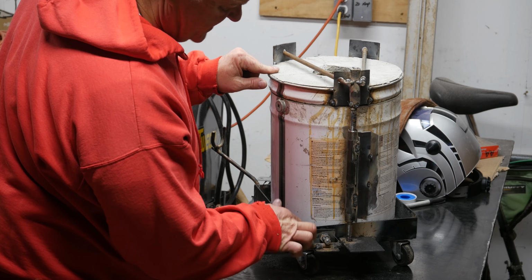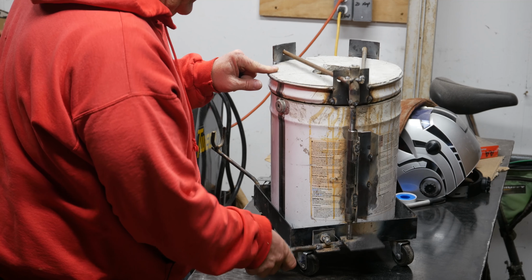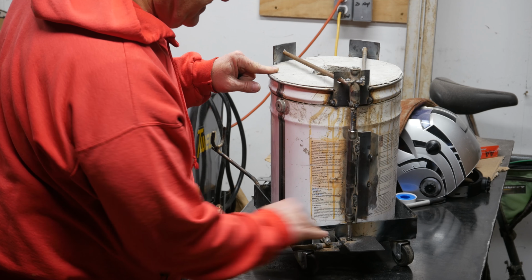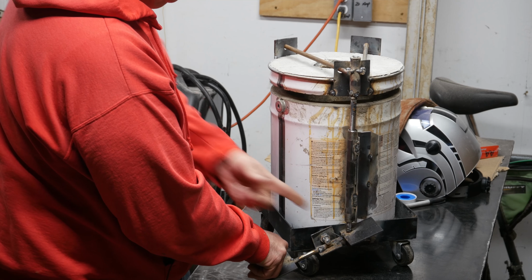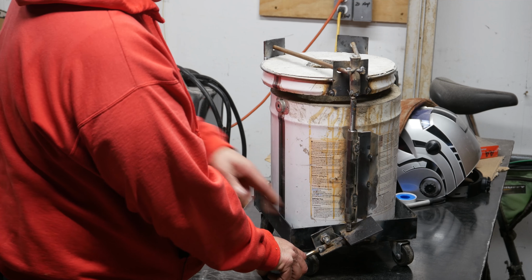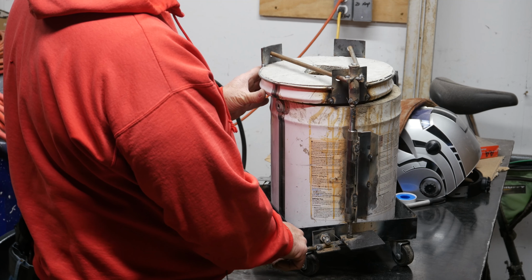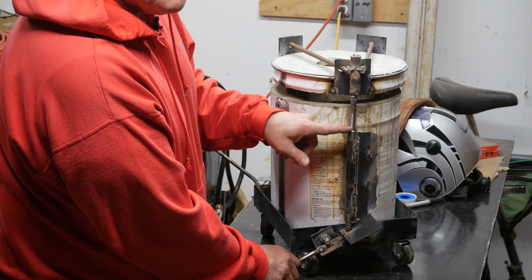And it's pretty simple. I've just got a piece of angle iron with a hole drilled through it and a bolt running through the frame here. Then I welded this piece of 3/8 inch round bar on here, and then these two pieces of plate. So the idea is, push the plate down, it lifts this one up, and it will lift that rebar up. I have taken the rebar and cupped it, rounded it, which made a huge difference as far as being able to slide across here. When I had it just cut off, it was digging in and binding, so that was helpful. I also have cleaned up, you can see it's probably shiny up through here.